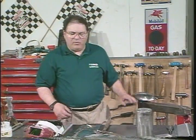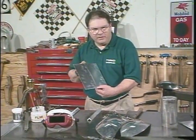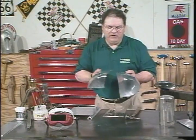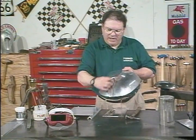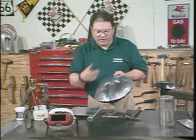We're going to do several projects today. First, we're going to weld these two pieces together — we're going to tack them and weld them. This is a normal butt weld. I've got a couple of preformed parts here that we made as part of our projects in our workshop class. We're going to show how to cut the trim line in, then the other side, then put a witness line in, and then gas weld them together.